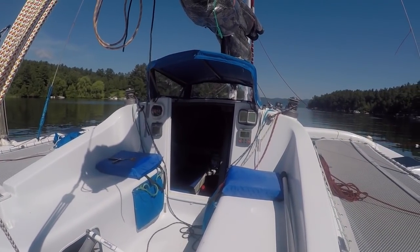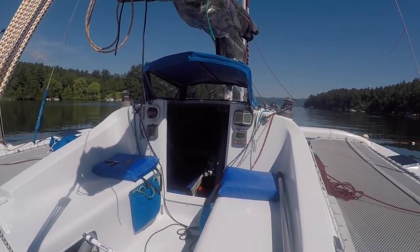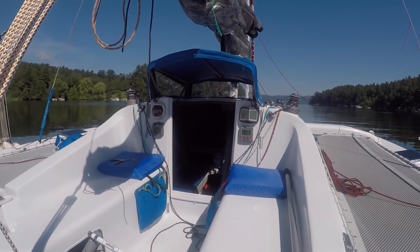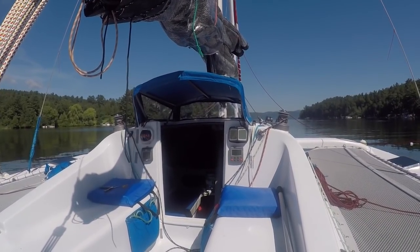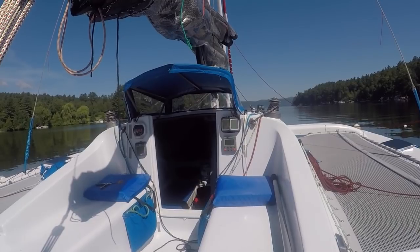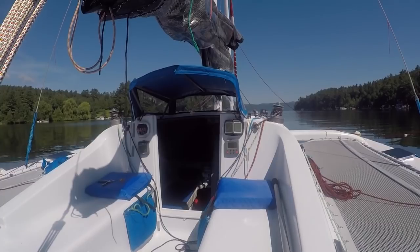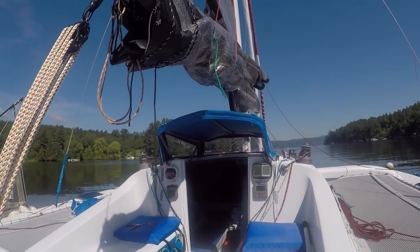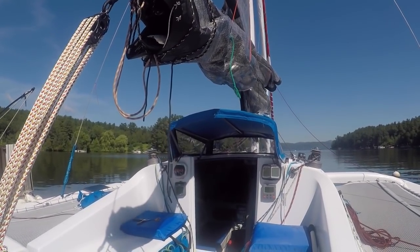So I'm moving into the boat here and ignoring all the tiny little repairs I did. Up at the bow I did some work just here and there around the windows — it wasn't much to do actually. So the Dodger. The Dodger is my design. Design goals were extremely low profile. I needed standing headroom and essentially permanent — because when I put the boat in the water, the hatch comes off and remains ashore. The hatch I made out of carbon fiber and Corecel and it's super light, but getting rid of it — canvas is even lighter. So it's free standing. You can see the poles.